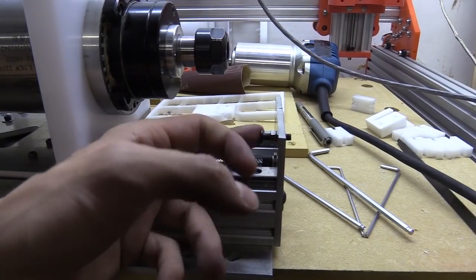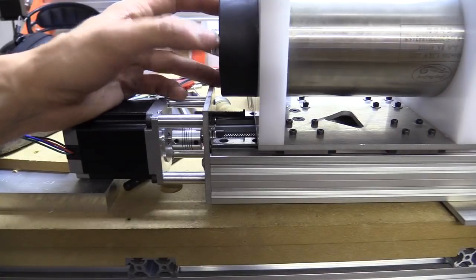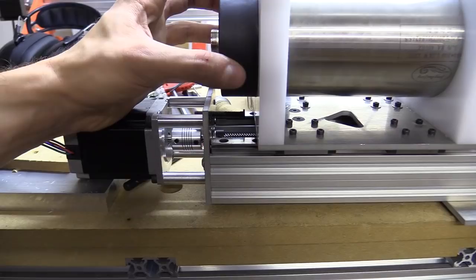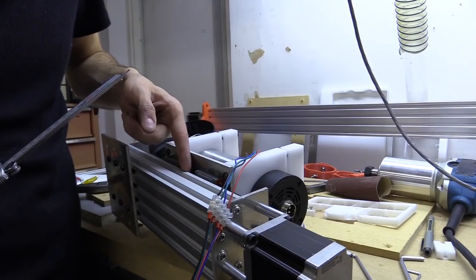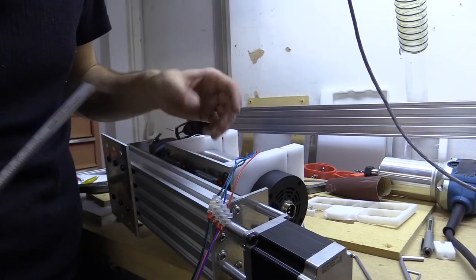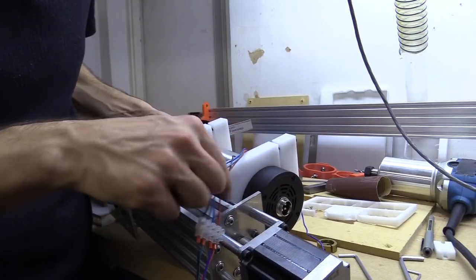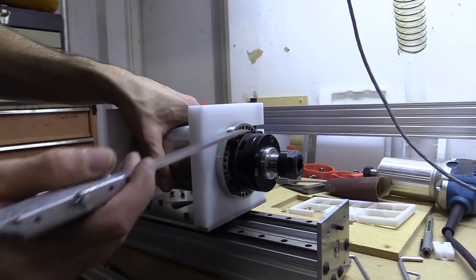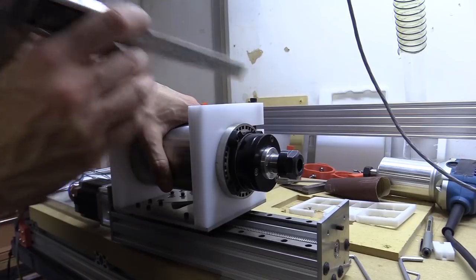So just place the hard stops in position. Somehow overlooked it, but this is really close to that. So the distance between the back of the plate and the face of the aluminium extrusion that faces the plate is 13 mil, and that's correct. So the error is in the acetal plates that I cut. No, the error is in me having reduced the thickness of the plate, but not doing so in the 3D model or compensating with the positioning of the spindle opening.